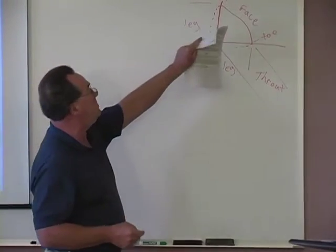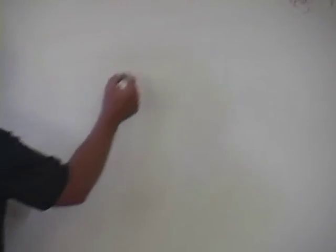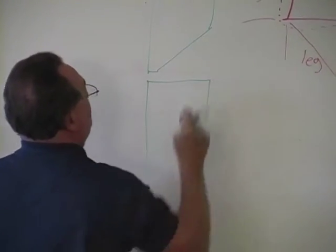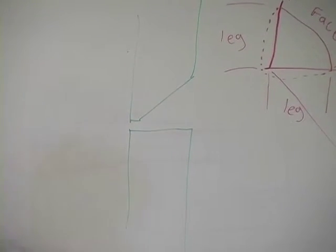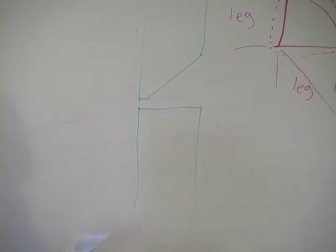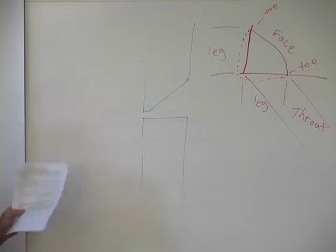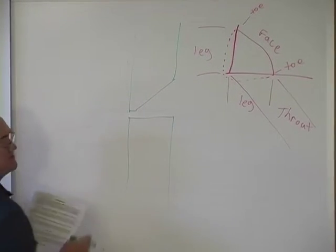This next section talks about groove welds — primarily for pile welding, whether H-piles or pipe piles. That's where you want a structural member to act like it's continuous across a splice. What this is talking about is what kind of fit-up you need on this H-pile or pipe pile. It states that alignment needs to be within 10% of the thickness of the material. Most piles I've seen are between 3/8 and 5/8 of an inch thick, so less than a sixteenth of an inch of misalignment is all that's allowed.